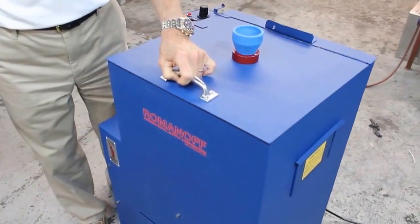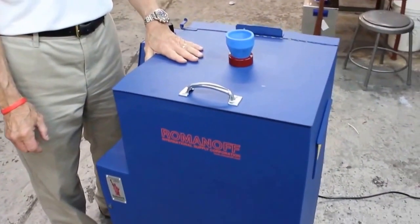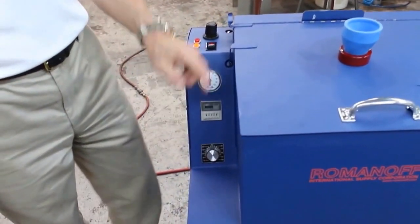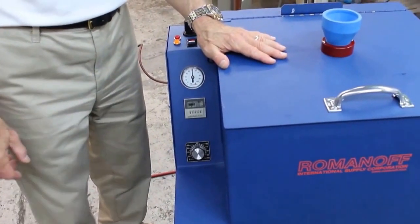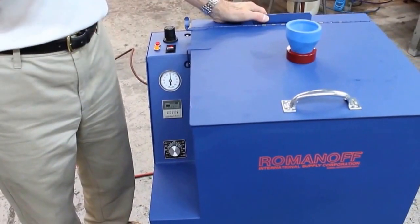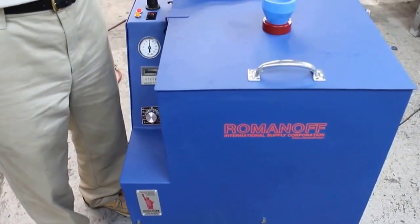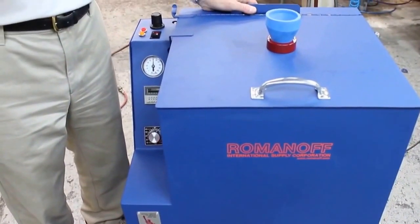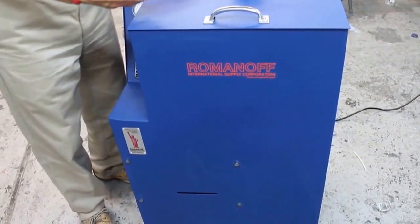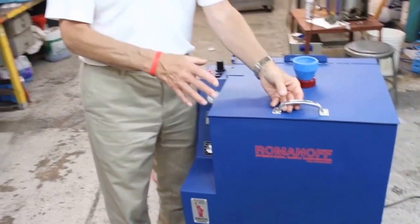As you close the door of the machine completely, it begins spinning at the RPM you have selected. Available RPMs range from 90 up to 950. A higher RPM is used for casting extremely thin pieces, providing more force for metal to flow into very thin cavities. A slower RPM is used for very heavy pieces so the metal doesn't break through the rubber mold. After 20 or 30 seconds — whatever the timer is set for — the machine stops automatically.